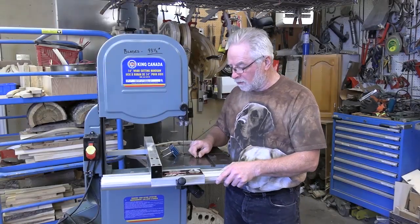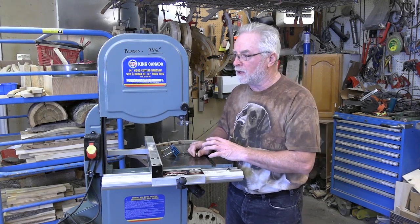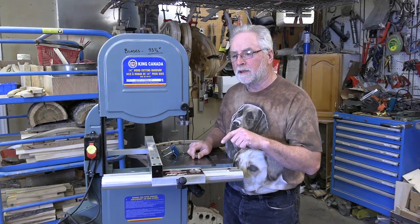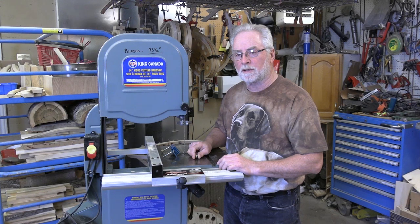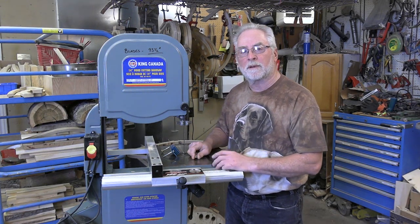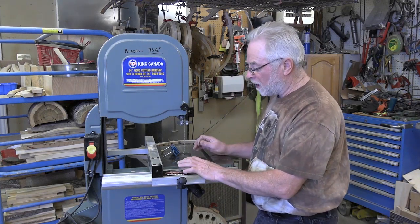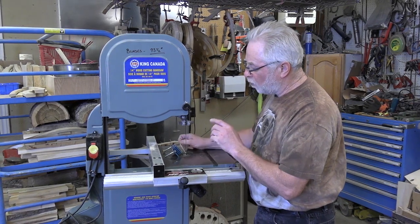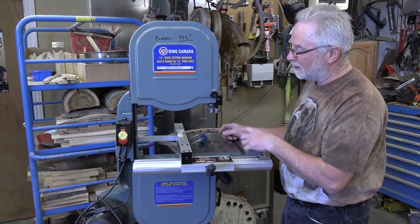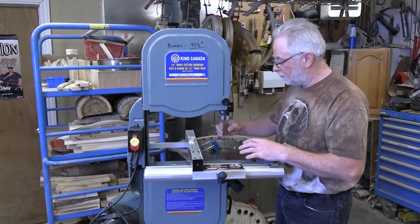In this session we're going to do a little overview of the tools we're using. Because of the production volume I'm using power tools, though I'll allude to the hand tools people would have used years ago if producing a pair infrequently. Right now I'm at the bandsaw — it's a 14-inch King. The reason I've gone with it is its two-pulley system, which is more direct, and it has a single horsepower.